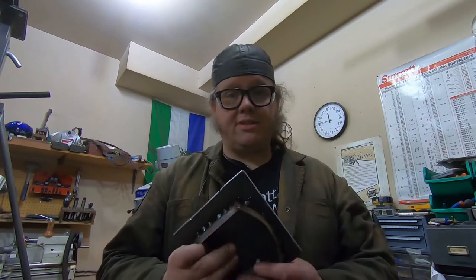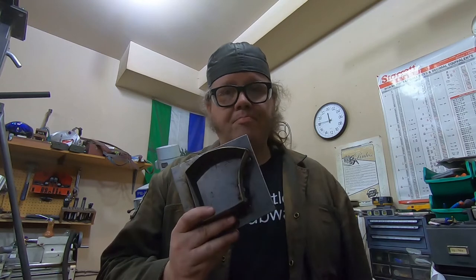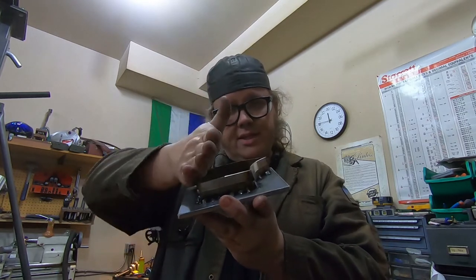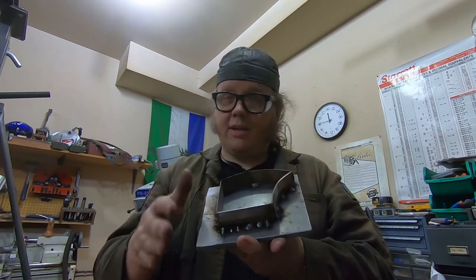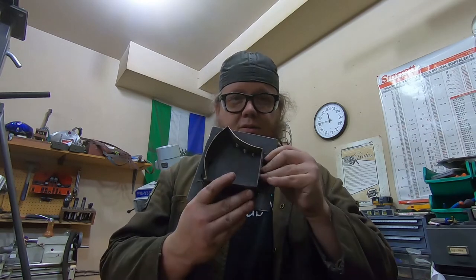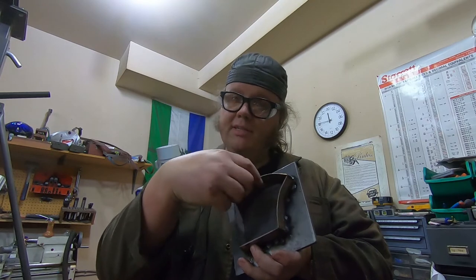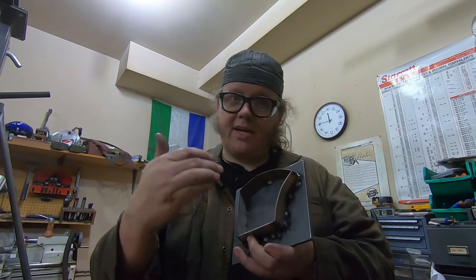So, after some more experimentation, I'm coming to the conclusion this just doesn't work. Fun little project, nothing I'd done before. I don't know if the correct solution is maybe to have a roller system instead of a single press so that the force would just be concentrated in smaller areas so you could get higher pressure easier. Because once you get up to something this size, you're spreading that force out over quite an area. Or maybe you need to have an internal die that matches this shape that's pushing inside, so you actually get like a shearing scissor action.